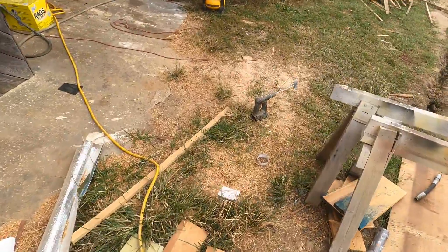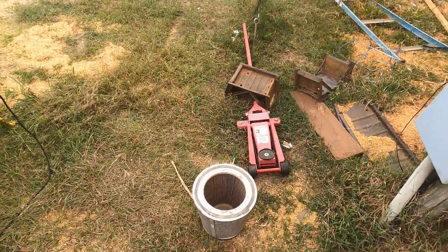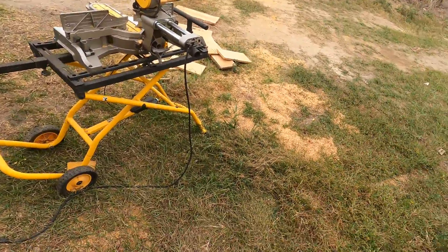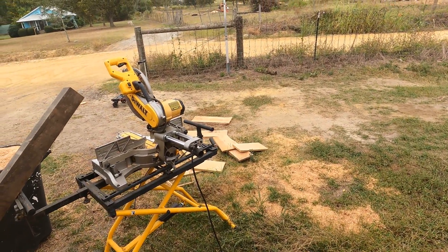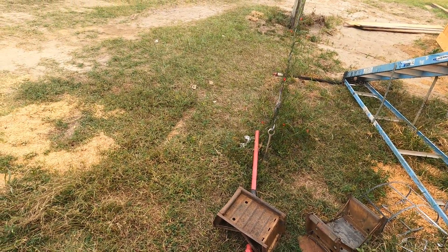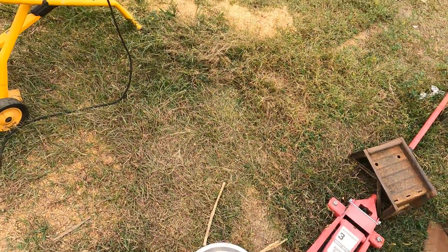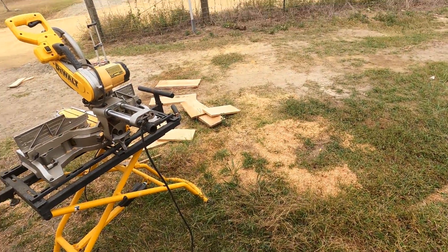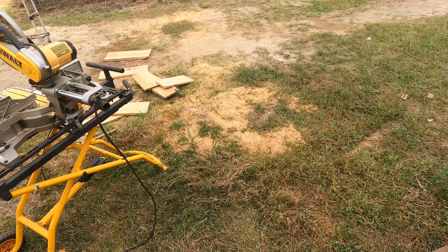Here's a little bit about the Supercell. I've got the new Powermatic three horsepower dust collector and it works awesome. The Supercell works great too, but it's got high pressure and not as much airflow. The Powermatic is low pressure, high volume. The Supercell is low volume, high pressure.